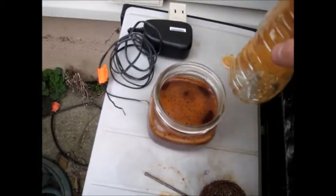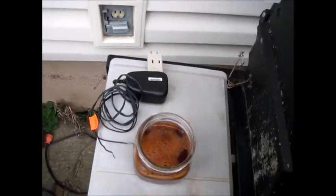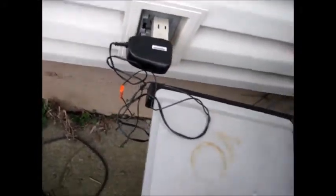Alright, there's all the solution in there. Set this up here, put the lid back on it. Here I have a penny I want to try to plate. We're just cleaning it off with some rubbing alcohol — isopropanol. Alright, that should be fairly clean, clean enough at least. Now you can see I have the penny connected to the negative wire just with a paper clip, and we have a nail here as our anode connected to the positive wire. So let's go ahead and plug in this 12-volt adapter.